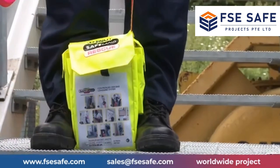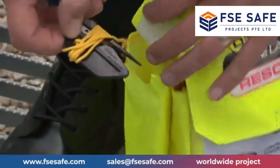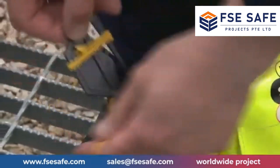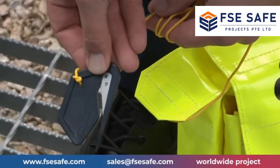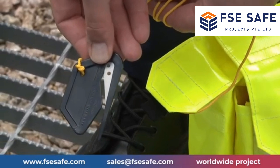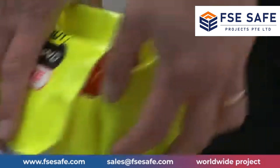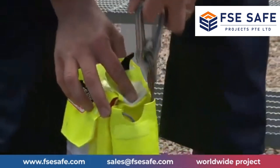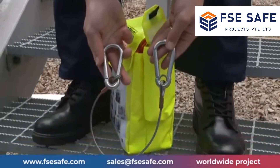Other accessories on the unit: in the side pocket of the bag there is an emergency knife. The knife has a guarded blade and is retrievable if dropped via a lanyard attached to the bag. Use the knife only as a last resort to cut the casualty free from the rescue unit or to assist others. In the opposite pocket of the bag, there's a wire strop, which will be used in the event you have to attach to any structural elements where the securing carabiner cannot be fitted directly.